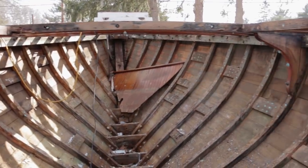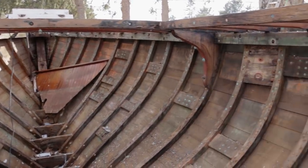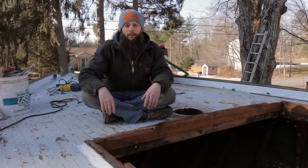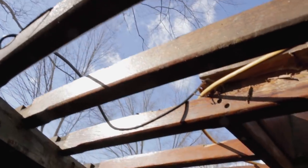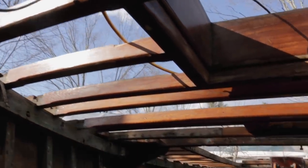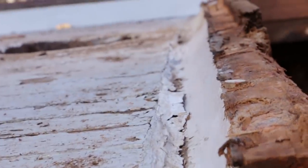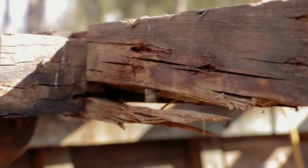It's really neat to take Victoria apart slowly, and that's part of the reason you see us running the vacuum all the time and trying to be neat about it. One is so we don't get paint chips everywhere, but two is so we can see and notice small details about where things sagged, where things shifted. A lot of it is classic stuff we've read about, like the mast tie rods, but it's cool to see that actually in practice.